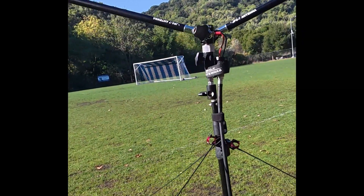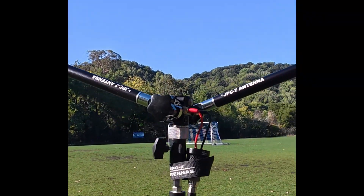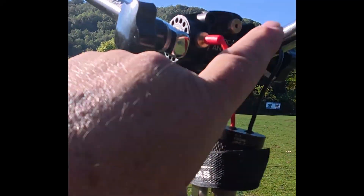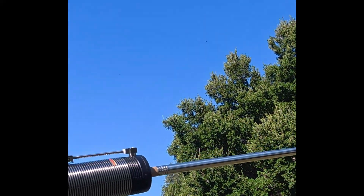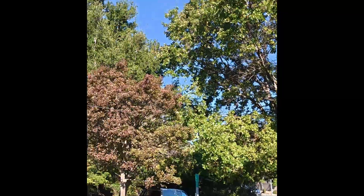Alright, let me show you what I've got. So I've got it set in a north-south orientation because I'm on the west coast - I want to go as much east or west as I can for any directivity out of this thing. So you've got this hooked up. This is a balun. I've got two of these. These are the aluminum poles, then the coil, then the whips. The whips are all the way out - it says to put them all the way out. You can adjust the whips for certain bands. I was able to get 20 and 40 with them fully extended with no problem. We'll see what it does out here. I wanted to get more room - I'm a little ways away from the trees. Let's tune this thing up and see how it works.